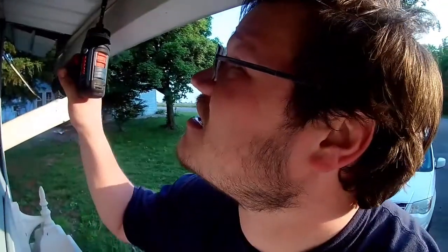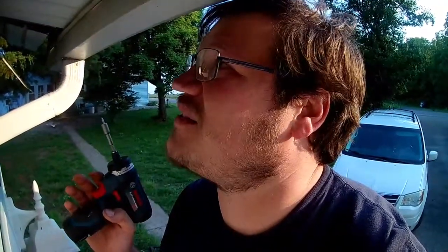You may need to sneak a board in up here above your F channel. A lot of people like to use J channel, and then they snip down the sides and fold it down. I'll show you what that looks like. Let's see if I can find a photo. And they fold that down, and that's really not awesome. But if you secure the soffit to the actual board with the screws, it's not going to blow down. So I have a nice board up here on this side, and then this side we have the F channel. So we're going to put two screws in.